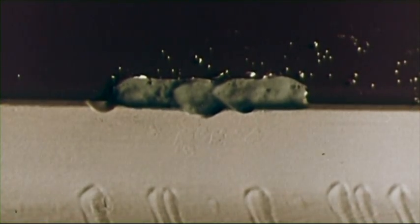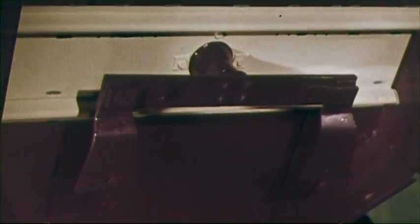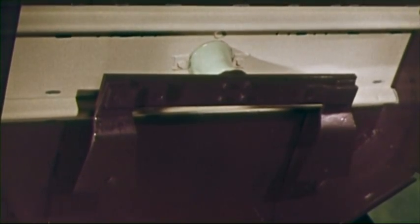This torsion frame, identified in light yellow, is one solid piece, 1/4 inch thick. One single piece of formed steel, welded, as shown here in blue, to the housing in the inner slots and along the outer edges. The torsion frame builds in both beam strength and resistance against twisting and provides a solid mounting for the spindle housing.